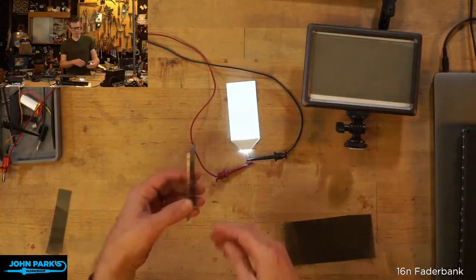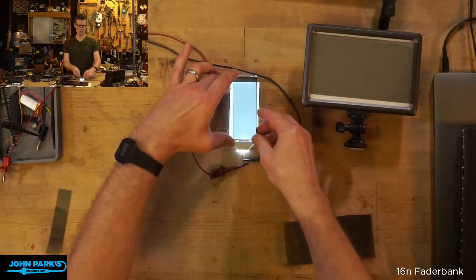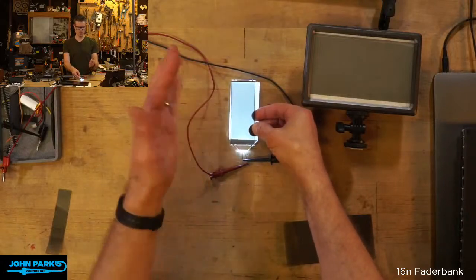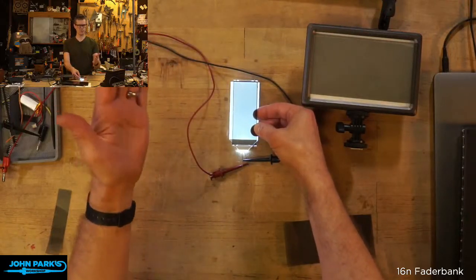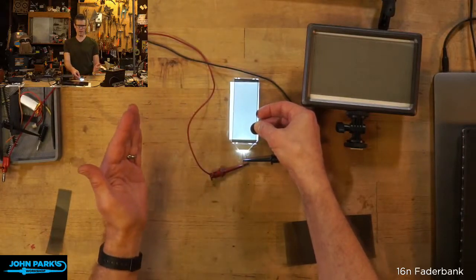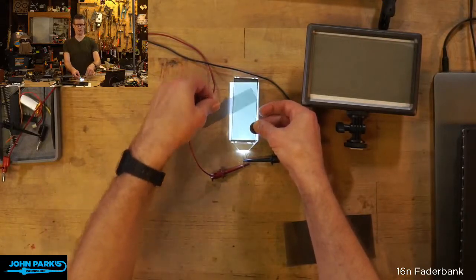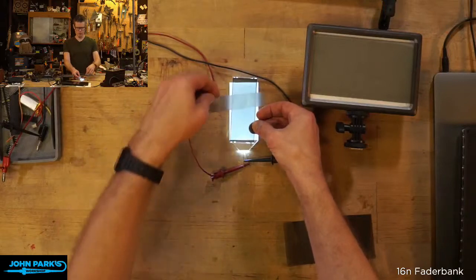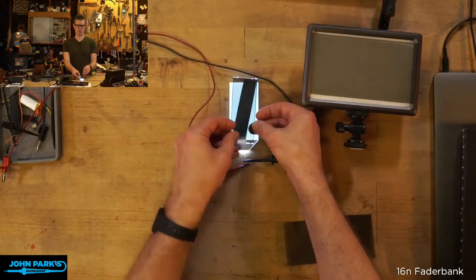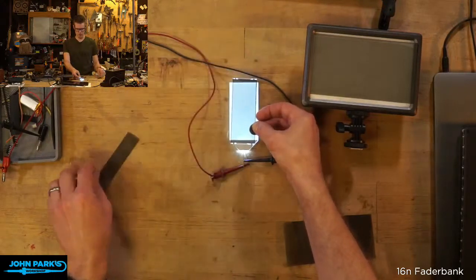And another interesting thing I noticed is that we have these sort of welding glasses LCD light blockers. If you give these a couple volts, I think maybe 3 to 5 will work, it will turn this very opaque. Block light is how welding glasses work. But it too is polarized. So if you have one or two of these things, or if you have some film in one of these things, you also have some options for both changing polarizations and turning these things on and off.